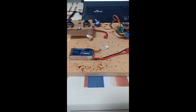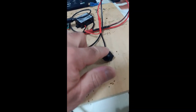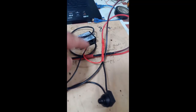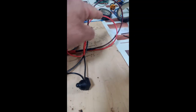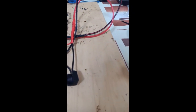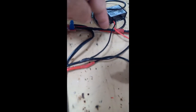About connections — I want to make it clear. Here's the battery. The positive wire goes into the switch. From the switch there are two wires: one goes into the converter and one goes to MOSFET. There is also a black ground wire — the ground wire goes to the converter, and another ground wire goes to MOSFET.